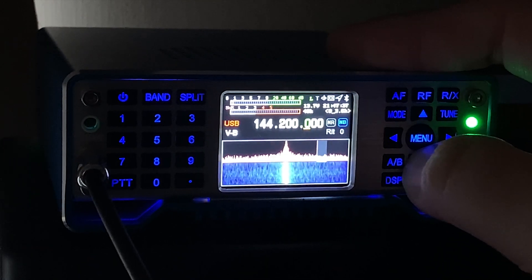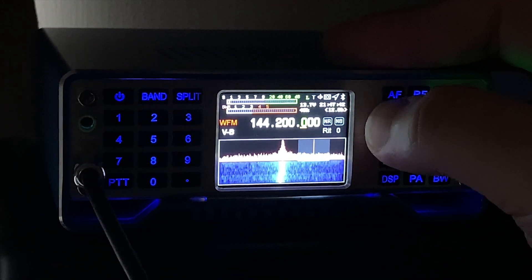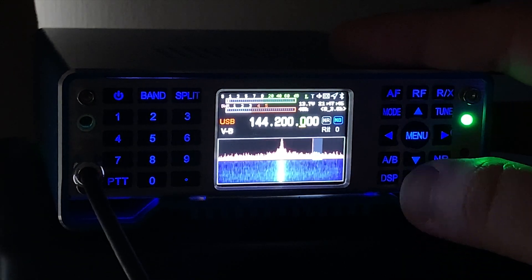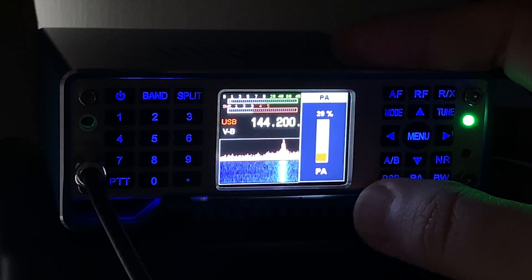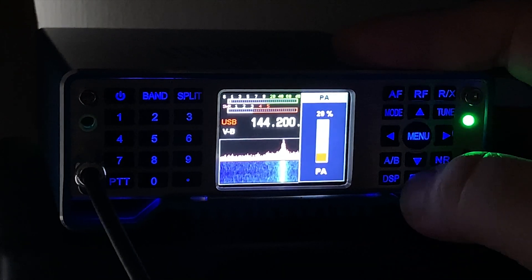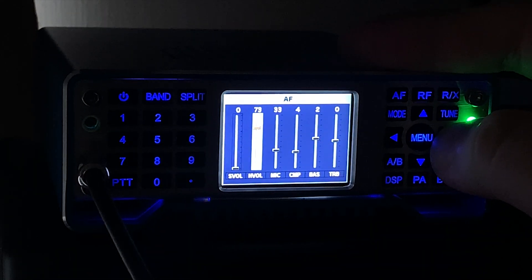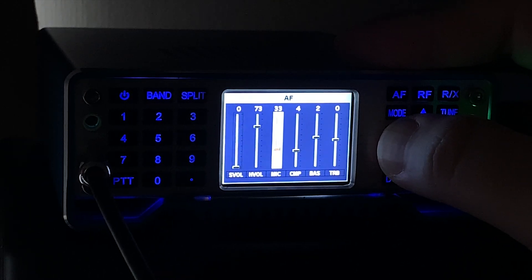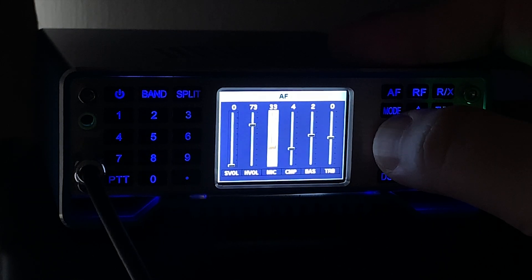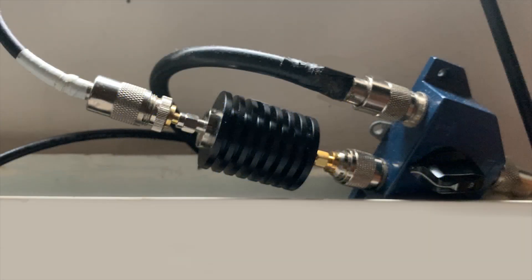The first thing I need to do is set up the HS2 to the 2-meter band and then select the USB mode. I'll also adjust the power level to its lowest setting. The DX Patrol up-converter can take up to 3 watts input for a 250 milliwatt output, but the SGLabs V3 amplifier only requires around 14 milliwatts for full 20 watts output. To load the output from the HS2 further, I've inserted a 3 dB attenuator between the radio and the transverter.